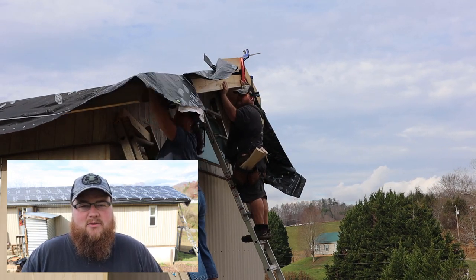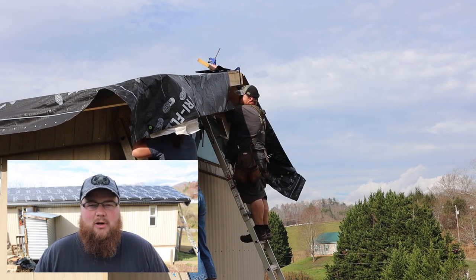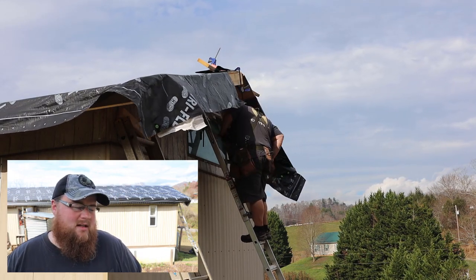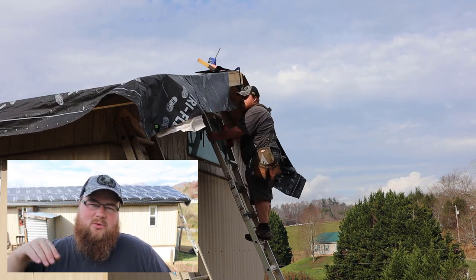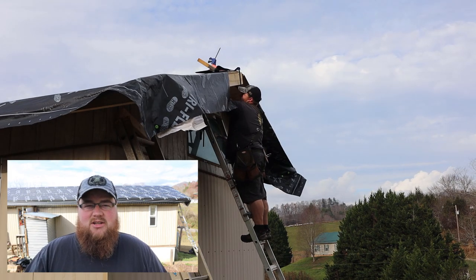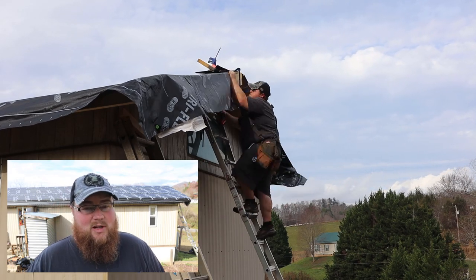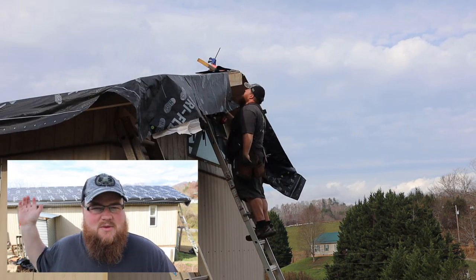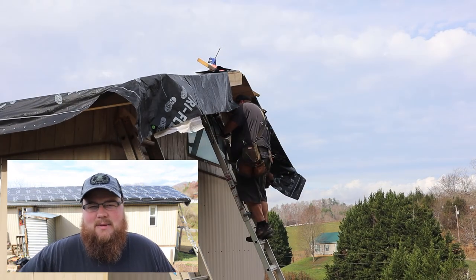I bought 40 sheets of plywood for this roof and had a couple left over, but I wanted to make sure I ordered enough to do the whole project. I also used 2x4s for a lot of the framing of the eaves, overhangs, and gable ends — close to 30 of them. For the sub fascia boards on the eaves and gables I used 2x6s, 24 of those at 10 feet long. For attaching the plywood we used 3.5-inch galvanized ring shank nails — about 1,200 of those. For assembling the eave, rafter, soffit, and overhang framing with the 2x4s and 2x6s, I used 3.5-inch exterior-grade screws — about 750 of them.